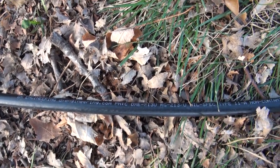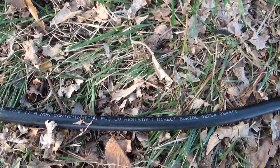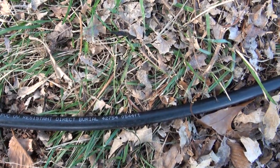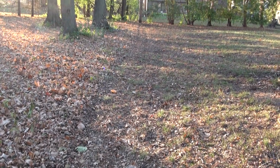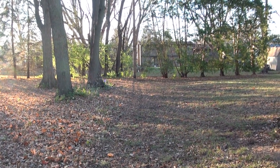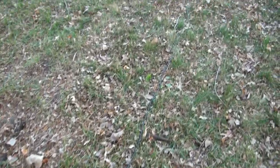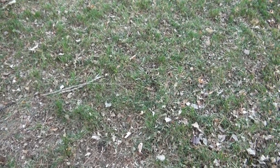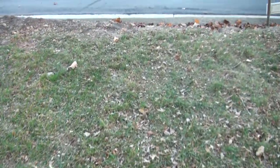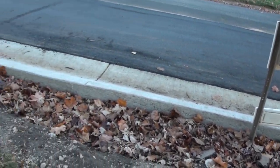The coax I'm using is DX Engineering's RG213U. I'll eventually replace this with LMR400, but in the meantime this is what I had available and I just wanted to see if the antenna would work. Here's a look at one of the two ground radials I have with the EZJ — it runs along the south edge of my property to the west edge, where it bends in an L shape to the north, but it's all on my lot. Here's a look at the second ground radial, and this one heads towards the east. I want to do the same thing with this as I did with the west ground radial — turn it into an L configuration and keep it on my property. But right now I can't, because that area is under construction thanks to a broken water main.